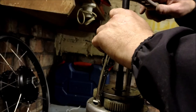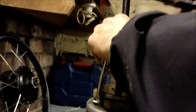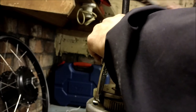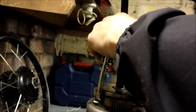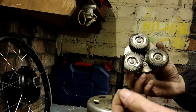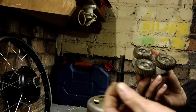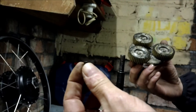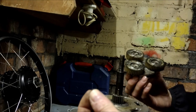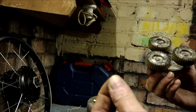I'm going to pull the planetary gears off one last time — you need a bit of a puller to do it — just to rule out maybe they are actually causing the problem. I don't think so, but... what the hell is this? This is like a rivet top I just found inside the gears. Oh my god, have I just knocked this off now or has that always been sat in there just waiting to chew the gears?